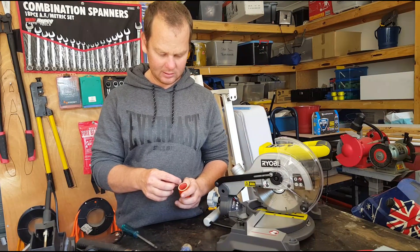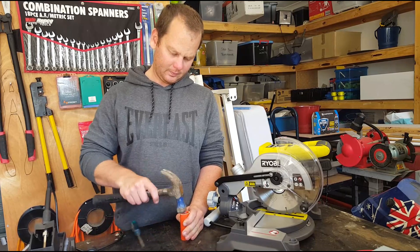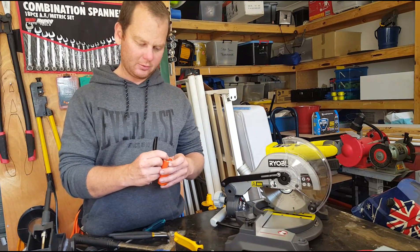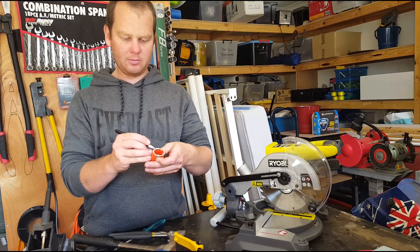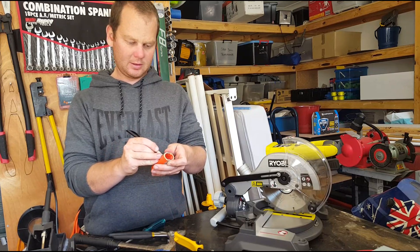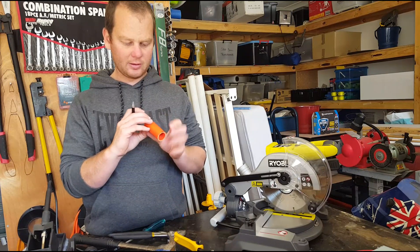What I've come up with here is just a bit of a pipe saddle bent over at the end. Once you've got your bits of metal bent up or whatever, you want to trace out around them. You're going to have to put a little groove in there somewhere just so the back end of it doesn't catch when it pulls in and out.